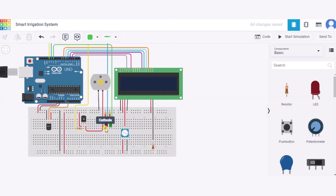Now let us see how to connect the LEDs. The cathode pin of each LED will be connected through a resistor to the GND pin of the Arduino, and the anode terminals will be connected to pins 11 and 12 of the Arduino respectively.